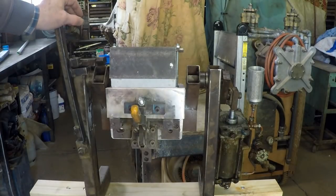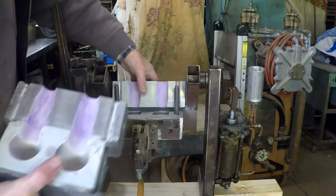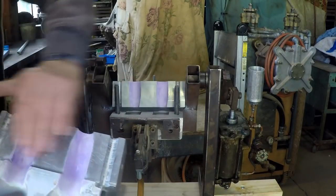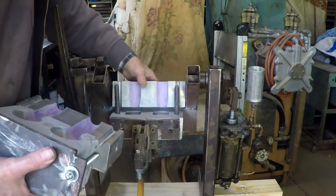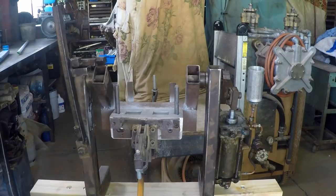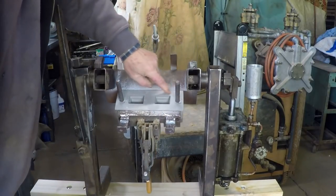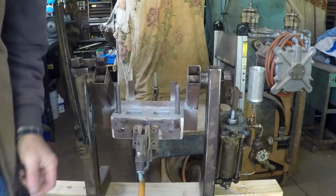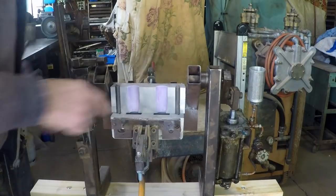This is my little setup for doing tilt casting. There are the two extra blocks I cast — these form the top half of the die and they've got the feeder cavities cut into them. There's been some machining done: the faces cleaned off, dowel holes drilled with the two halves bolted together. Here is the die block itself with the two cavities. The top has been machined, the front and back faces done, holes drilled and tapped, and dowels put in place. The two top die halves are just held in by over-centre clamps.